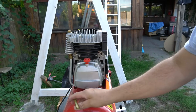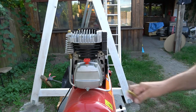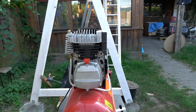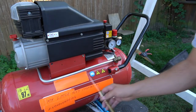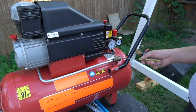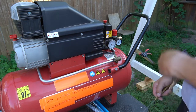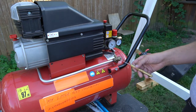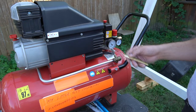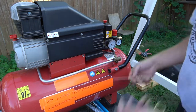The air is going through this aluminum pipe straight into the air tank. Pressure pipe, check valve — the air can go into the air tank but can't come back into the pressure pipe. It means when the compressor stops and starts again, we are unloading this pipe so it's pressureless and the compressor is not starting against pressure in this pipe.